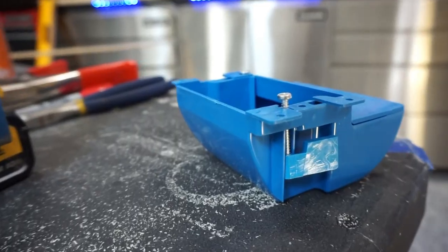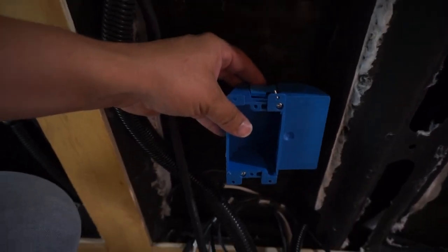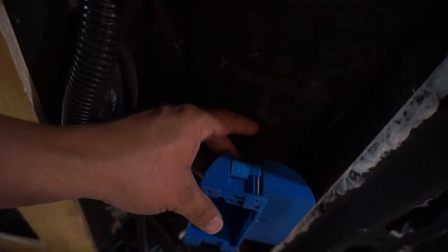We're gonna use some eight-by-five-eighths Robertson head screws to hold it all together, because when you glue and screw it, if you try and pull it apart, it holds them solid. And you're gonna need some electrical boxes for the 115-volt plugs that we're gonna have in our walls. These were off Amazon — shallow depth plastic housing that can mount into where our walls are gonna be and still give room behind the wall so it's not touching our insulation. Now that we're at 500 subscribers, all the links are tagged below. I went back through almost all our videos and put a Canada link and a US link depending on where you're viewing from.